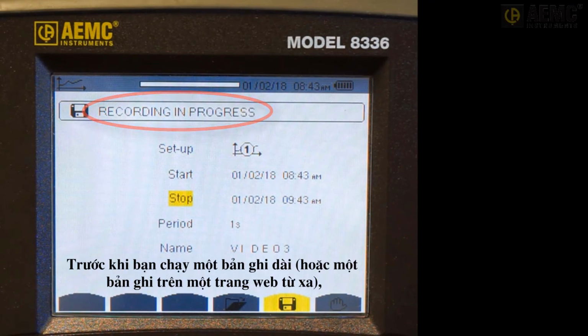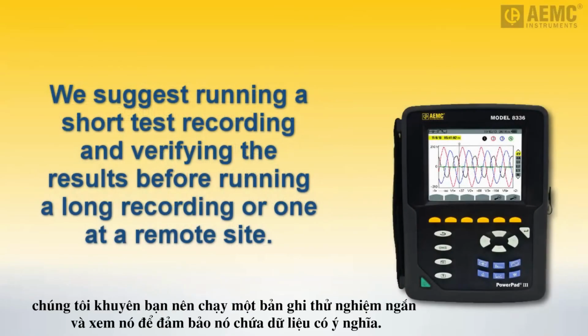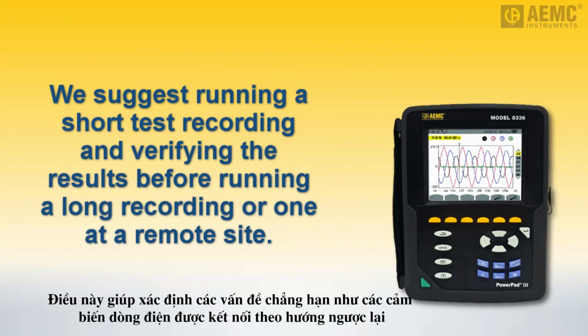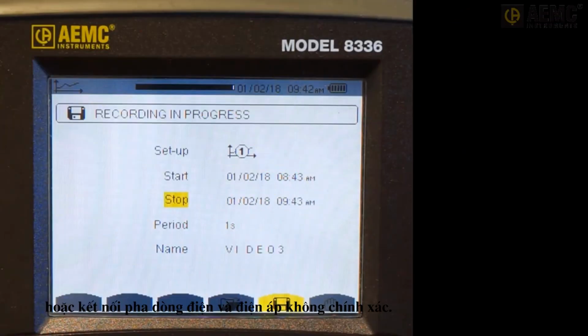As a good practice, before you run a long recording, or one at a remote site, we recommend running a short test recording and viewing it to ensure it contains meaningful data. This helps identify issues, such as current probes connected in reverse directions or incorrect current and voltage phase connections.